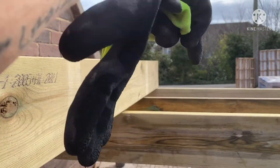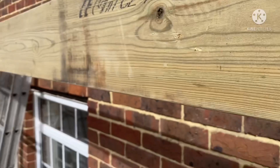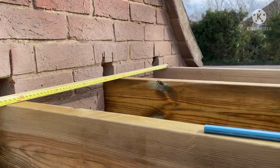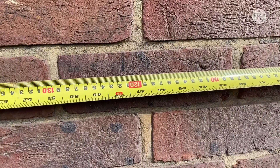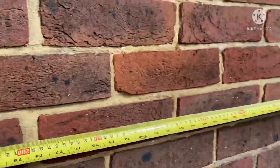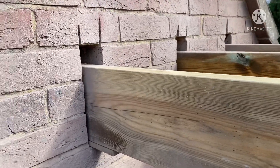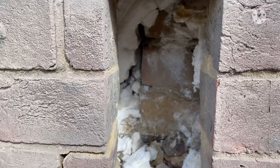Make sure your last beam over there is level. Put a straight edge along the top — you're going to use the timber joist, make sure it's not bowed, make sure it's level, and then measure your gap underneath and cut the packer off, put it under there. When marking out for your timbers, measure to the wall side of that timber at 1200mm, because then that's half a sheet of plasterboard, and then 2.4 there — that means plasterboard and your flooring will work without having to cut them down. Cut that out with a spinner, plug them in after, then they won't move, and you keep track because you've got joists in there — make sure that they marry up with your joists out here.